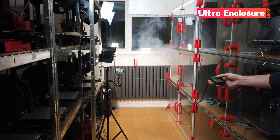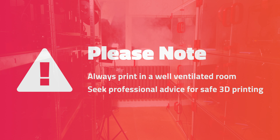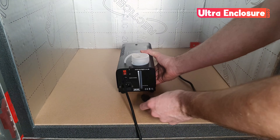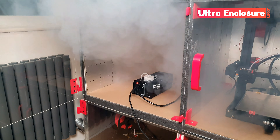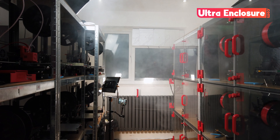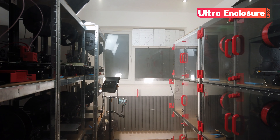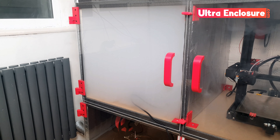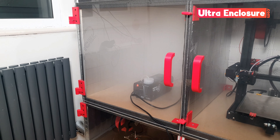The second major advantage of using an enclosure is that it generally reduces the smells and gases that get pumped into the room. As a side point, whilst this enclosure may help, it is in no way guaranteed to contain any or all dangerous gases. You should always 3D print in a well ventilated room and seek further professional guidance on best practice for healthy and safe 3D printing. For my test I'm going to use a smoke machine to visualise the spread of gas and its movement. First off I placed the smoke machine inside a chamber with the door removed — for each test I'll activate the machine for 15 seconds to create an equal volume of smoke. As you can see in the footage it very quickly fills the entire room, and what may be hard to pick up on camera is the haze that was in the air for a significant amount of time after the test. For the second test I'm going to return the door and close it. As you can see the same 15 second burst looks radically different — almost all of the smoke is contained within the chamber and even after 10 minutes the smoke is almost entirely contained within.